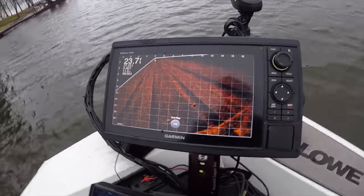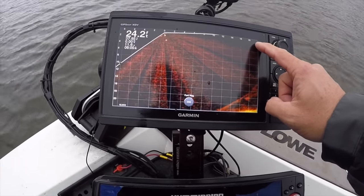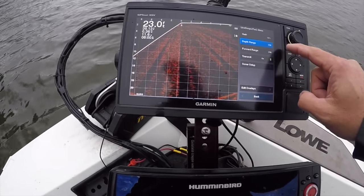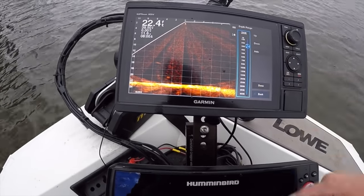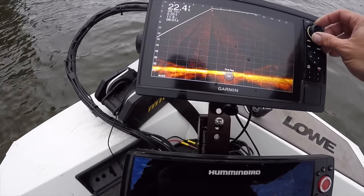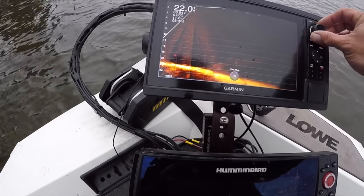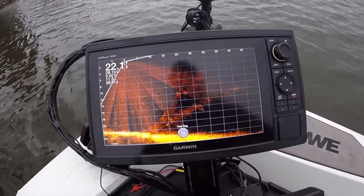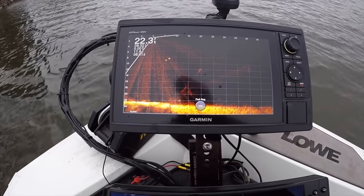So we're going to start off by talking about when you receive your unit. Your forward view is going to be set to automatic, and so is your depth. You need to go into your manual menu, go to depth range, and pick out a depth range you'll feel comfortable starting out at. What that automatically does is put you into manual so your device isn't going back and forth. Then as soon as you adjust your forward view — and this is the 1042 — adjusting that also positions it into a manual setting. You want to maximize whatever you're seeing on screen by setting both to manual. Otherwise it fluctuates back and forth throughout the day, which gets very frustrating.